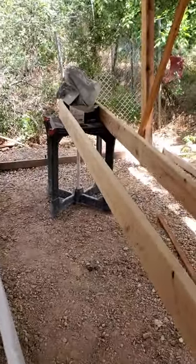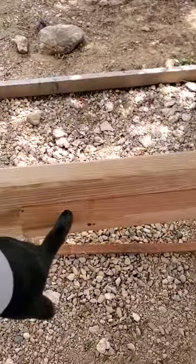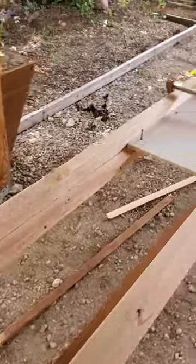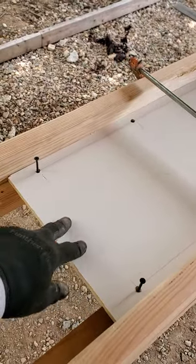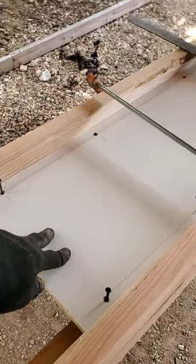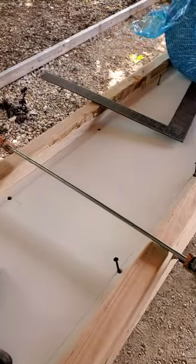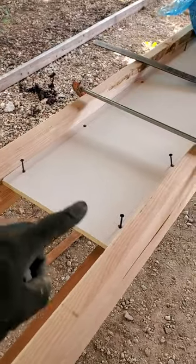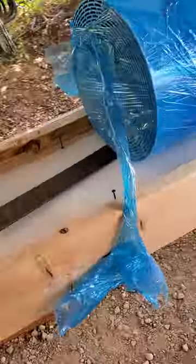The runners are 18 feet long — just 2 by 6. On top of the runners I have a cleat which is inch and 3/8 by inch and 3/8. This is glued and screwed together, and these are going to support a piece of half-inch melamine. I picked this instead of rollers because it has such a slippery surface, and I'm hoping the belt will run freely on it. It also seemed a great way to add rigidity to this as a unit and make it more like a box than two floppy things hanging out.